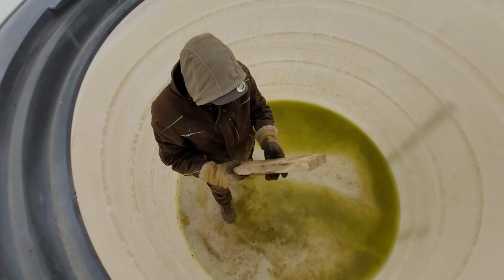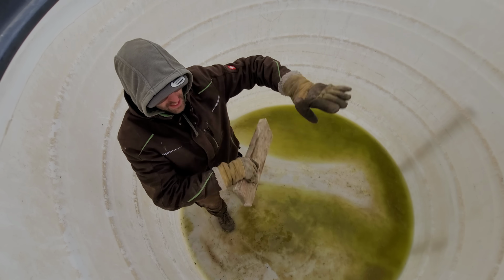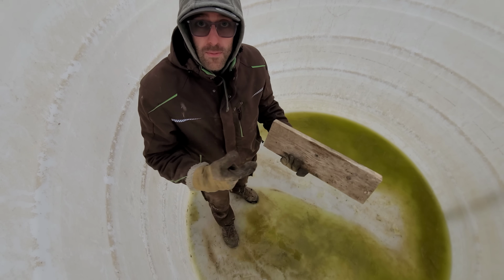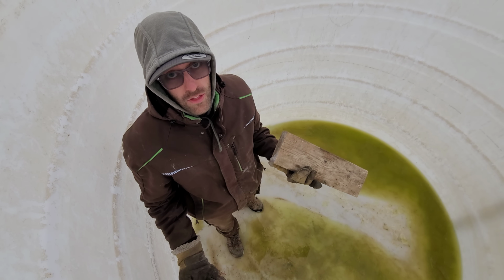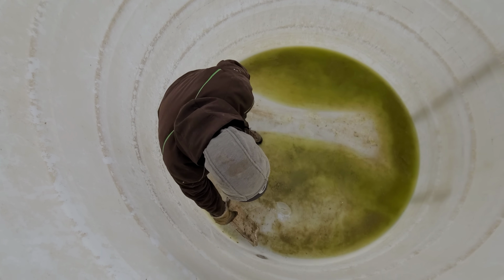There you go. Okay, so the reason again why we have to have this block of wood is because if we were going to cut a new 3-inch hole, say over here, wherever, it would not be a problem because you have that bit to keep it from wandering. Well, since we're going to round out this hole, we're going to recut this one. There's nothing for the bit to go into to keep that hole saw from just moving around, and all of a sudden you don't want to make a 3.5-inch hole by accident. You want a 3-inch hole, right? So I'm just going to hold this up here like this, and I'm going to hold it as hard as I can, preferably with my hand not right behind here so the bit can go through, and that way we make the cleanest cut possible. And if we didn't want to do that, then we would actually have to drill the new hole somewhere off and then plug this through.